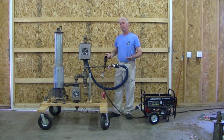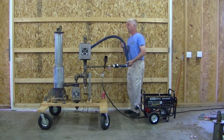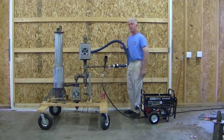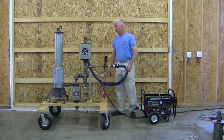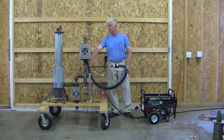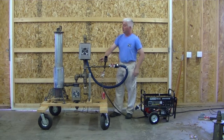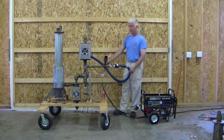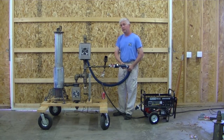Once I get a charcoal bed established, I don't want to jerk this thing time and time again to prime all of this volume, needing eight engine revolutions to pull a Coke can of volume forward — that's a good way to hurt yourself. Now what I can do is close this ball valve, open this ball valve, and I'm drawing the gas through the final filter, through the outlet back here, through the hose, and to the flare. I can flare my gas through the hose.